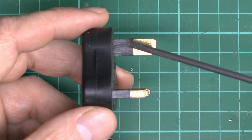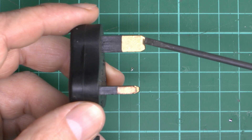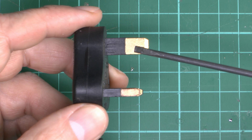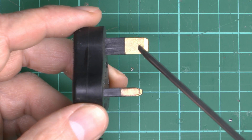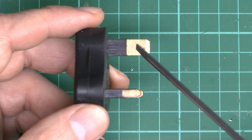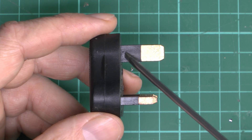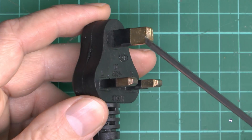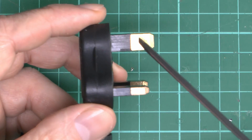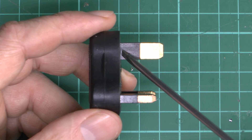In many sockets, the actual earth contact is near the front face of the socket, so as soon as you're putting the pin in it's making contact. But with the sleeving there, it quite often ends up actually gripping onto the plastic bit. So even though this has an earth pin, in plenty of outlets if you put it in there, it's going to grip on the plastic — meaning you're going to have no earth connection whatsoever.